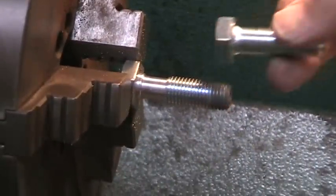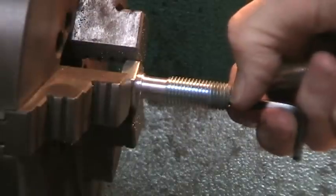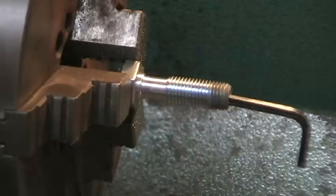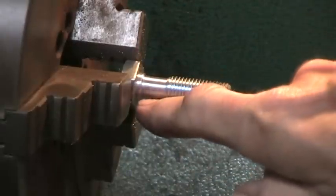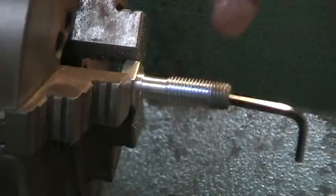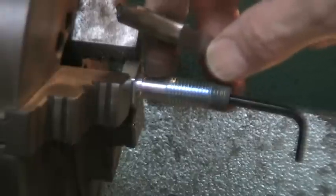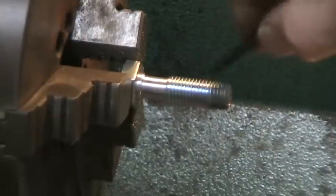Here's the old bolt. What I've done is drilled a quarter inch hole down the center of it — like that, that deep, quarter inch right in through the end. Then I took this tool and used it to cut away the threads right there. And I used this other tool to cut along the face of this. So there's a little shelf there that's the same diameter as the thread. This is as deep as I want to go — I don't want it to get too thin, because it's already maybe 75 thousandths wall. It's got to take a little bit of torque as you tighten it down, so I'm going to leave that a little thick.